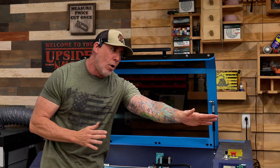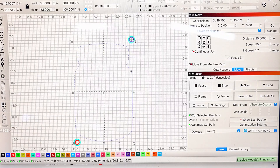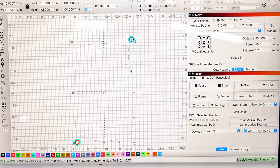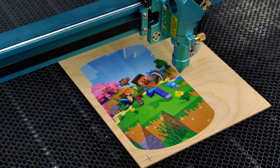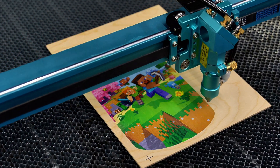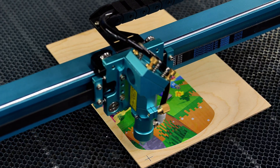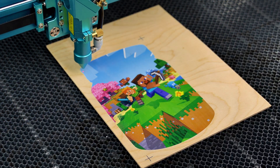I always like to do a quick sanity check. Inside Lightburn, you have two framing options. I'm going to highlight the shape we're doing our vector cut on and use the rubber band boundary framing. You're gonna notice that red dot simply tracing on the inside of our graphic — I do have a small bleed on this, and that's exactly what you're looking for. Always run this prior to cutting so you don't ruin material you've already printed.